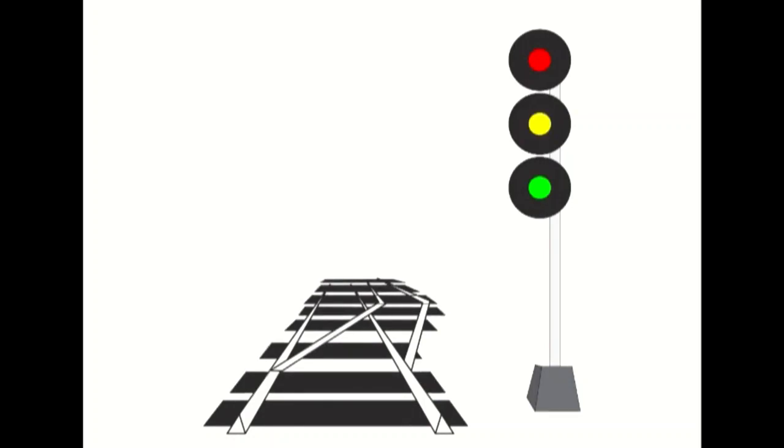The next signal down is represented by the bottom head. Obviously, the next signal will not be track speed, or else we just stick a green light on the bottom head, call it a slow to clear, and go home. The next signal is not a stop signal, otherwise we just make the middle head yellow, call it a medium to stop signal, pass by medium speed, stopping at the next signal. So that narrows down the meaning of the green on the bottom head. It represents what the next signal will be, and it has to be a medium speed signal.